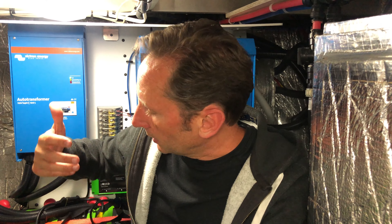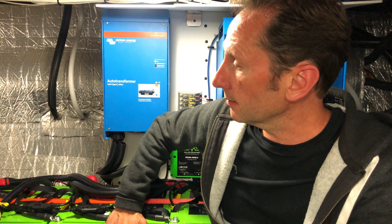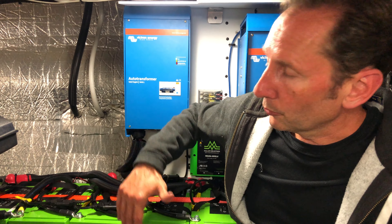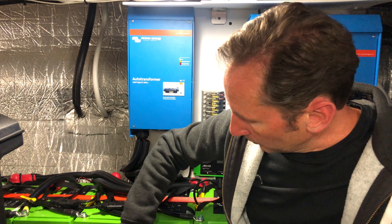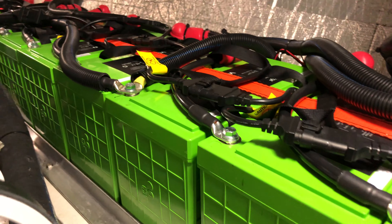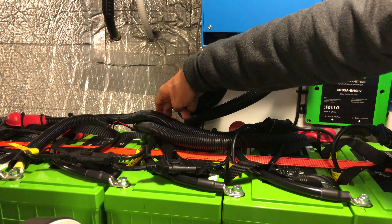How did you mount these batteries in the boat? Because they're lithium iron phosphate with no liquid inside, you could mount them upside down if you wanted. A lot of people saw them mounted without a battery box and thought the installation wasn't up to code — but that's actually not the case. The code specifies limits on battery movement at roll or if inverted. We installed aluminum tracks and strapped them all down as one unit so they simply can't move, and we made sure all positive connections are covered.